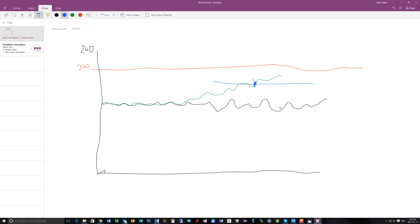And that's something that, if you were going to do that with external devices, you would have to have all fitted into the rack, all configured in and calibrated and everything else. When you buy this Phoenix Contact QUINT4 power supply, all of that's built in for you, which is really handy, because all you've got to do is connect it up to your monitoring device. That monitoring device could be simply a meter on a panel that indicates the power usage, and somebody goes and writes it down once every day or two. Or it could be more sophisticated, feeding into a PLC or some other remote monitoring device and up to a control center where it's actively monitored, alarmed and reported upon, so that you can look at trends over time, a bit like this rough and ready graph we've just done.